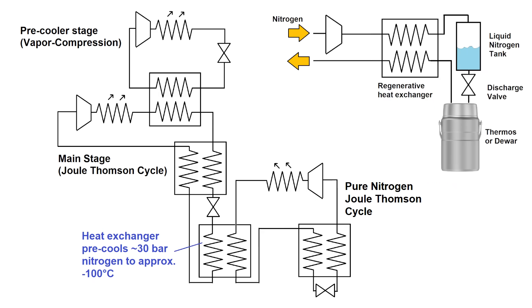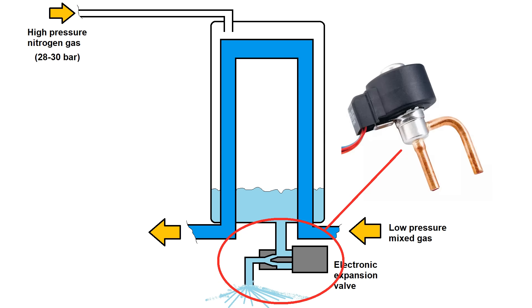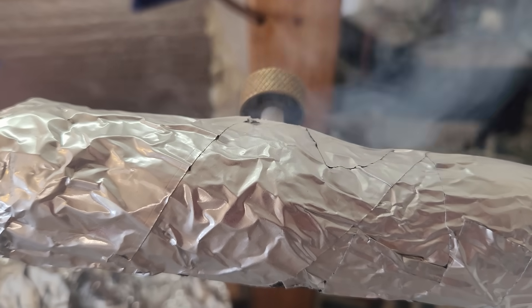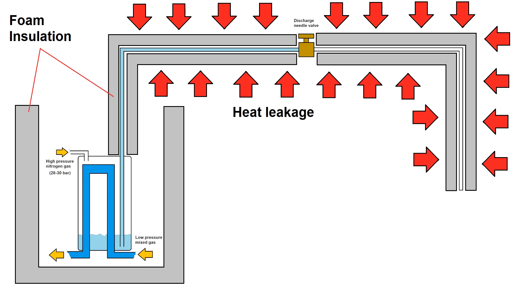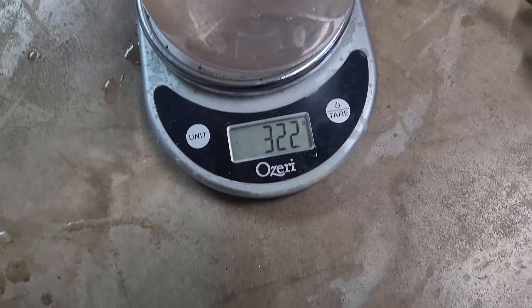My schemes to improve yield caused more problems than they solved, so I returned to my original plan of using a high-pressure liquid tank. This time I'd control the discharge from an electronic expansion valve placed directly underneath the tank. The needle valve I was previously using leaked when it got really cold because the Teflon seals would shrink — the electronic expansion valve was all metal, so it didn't have that problem. Also, several feet of tubing going out of the insulated box was causing huge losses. So I built yet another liquid tank, this time with a two-inch pipe instead of two-and-a-half inch. It holds at least 320 cc's, and it doesn't explode, so that's a plus.